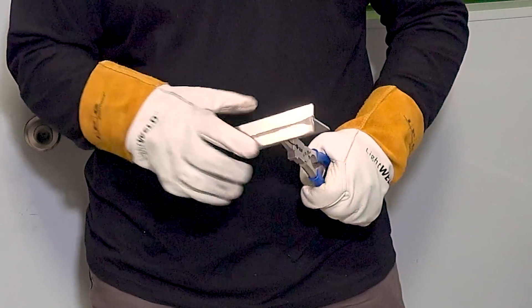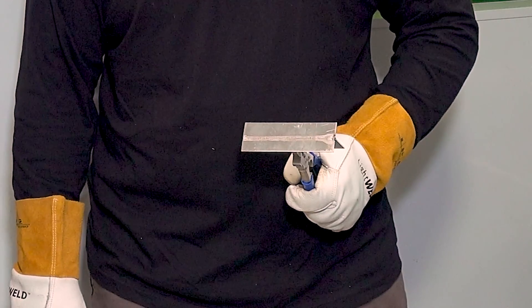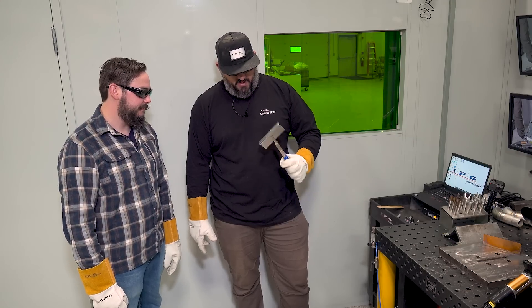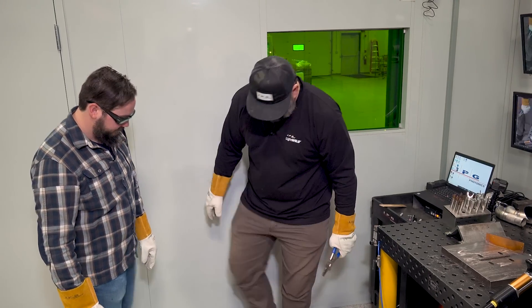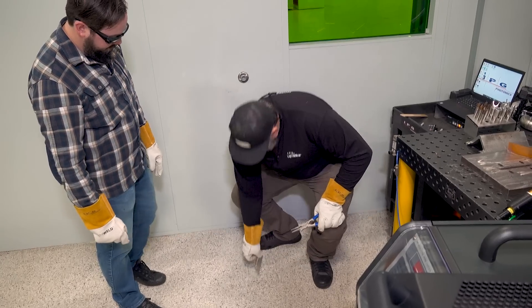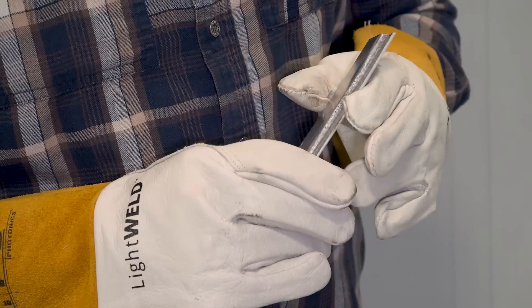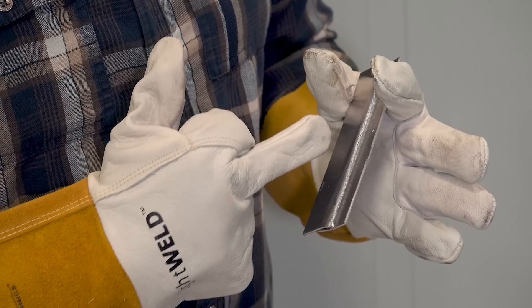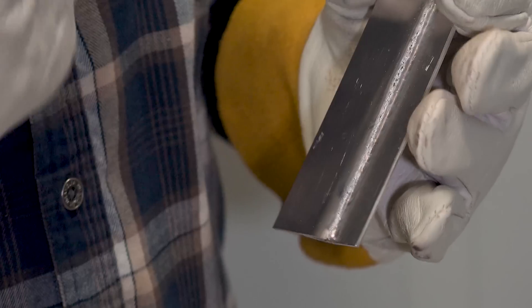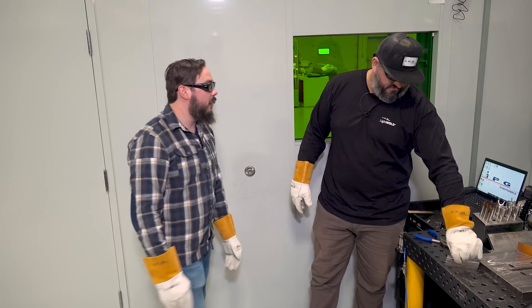Looking at that T-joint, I think that got full penetration. I may have gone a little slow, but it's still faster than TIG welding and you can absolutely see that's complete penetration. I weigh about 280 pounds, so let's see if I can break that sucker. That took some effort. The real test is — did the weld break? No. We got some cracking, but that's outside of the weld zone — that's in the base material. And that's what you want to see in a fillet weld break test. It penetrated completely; the weld itself is still there. Any cracking is in the base material, so we call that a pass. Faster, less heat input, and strong — that's all you can hope for.